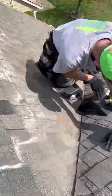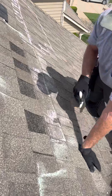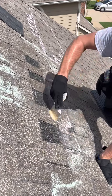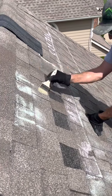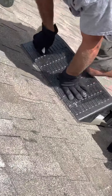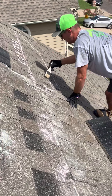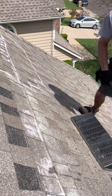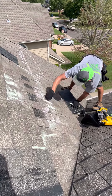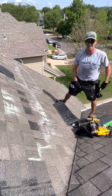Now last thing — go ahead and check granule loss. You can see granules coming off — see them coming all the way down, onto my pitch hopper. And remind you, the control — nothing, nothing on the control. That being said, with what we just did right here, I would have to go ahead and mark this as a failed repair attempt. Thank you for your time.